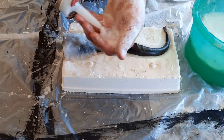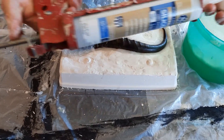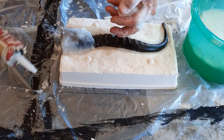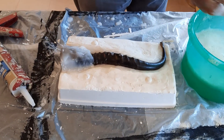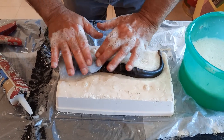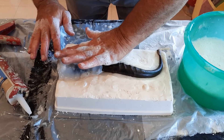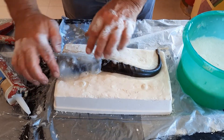This is not optimal to have my hands smudging. Remember, hit the trigger back so the silicone doesn't keep coming out. Make sure both your hands have soapy water, and just keep applying, pressing down the piece as you go along. Try and match your seams.